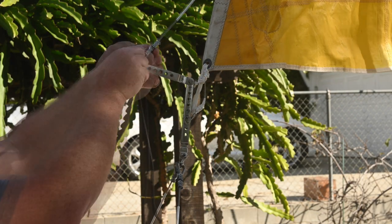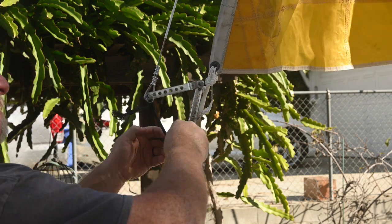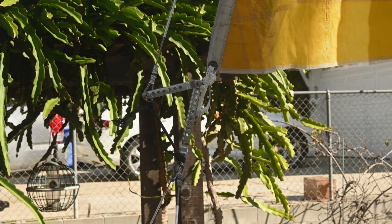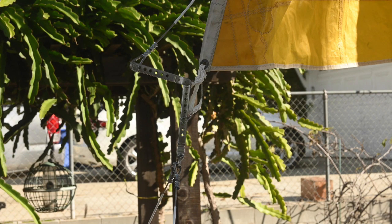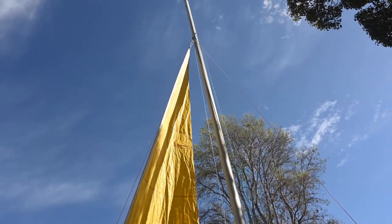Once you've got your jib tensioned, the forestay is going to go slack. Using two stay adjusters, like we've got here with the forestay attached to the top of the second one, allows you to do a trick that I actually learned from Joseph Bennett's YouTube channel, where he uses a piece of shock cord to tension that forestay and just keep it out of the way of the jib. It's not actually acting as a forestay unless the jib isn't raised. But you want to keep it out of the way, and using a little bit of shock cord will pull it forward and just keep it clear of the jib. So now I've got our jib raised, and you can see that the forestay is well clear of the jib.